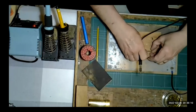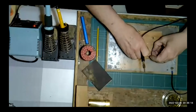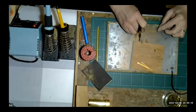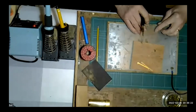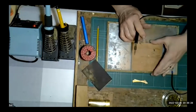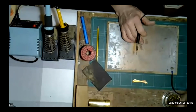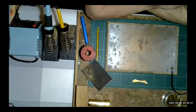If I do coupling rods, normally what I do, as an example, with a resistance soldering unit, I'll drill a couple of holes in the steel plate and put a couple of pins in, and then just literally join them together. This comes up with a query later on about not using a resistance soldering iron to laminate things together, so we'll discuss that one in a moment. But yeah, I tend to tin them with traditional solder using an iron and then finish them off on the RSU.